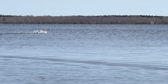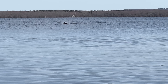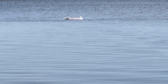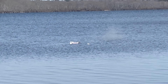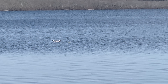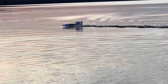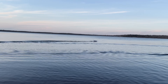Then, sadly, only after a few runs of the boat working so amazingly, I pushed the throttle a little too hard, it accelerated to too fast of a speed and it became unstable and flipped catastrophically, totaling it. I believe it flipped for a few reasons. The most obvious being the shape of the pink foam hull which forced air under itself and acted like a wing at such high speed. This also wasn't helped by the fact that it was driving into a headwind which was relatively gusty that day, especially for a craft as light and fragile as this. The breeze also introduced little ripples into the surface of the water, causing the front skimmers to bounce back and forth each time they struck one. This could have been avoided by waiting for a calm day like the first outing, or by shifting the CG or adding some downforce to the front to counteract the lift forces at higher speeds without drastically changing the weight of the vehicle. All that said, what happened happened and my EDF is now dead.